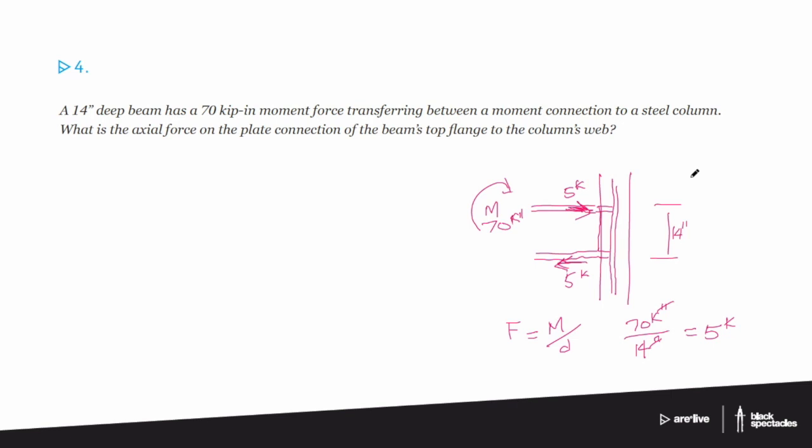They're a way to have a reasonable guess, to be able to answer reasonable questions about how deep a beam should be. It could be that in this scenario, it's not the worst case scenario, but it's pretty close to a worst case scenario. It's pretty safe if we assume this. What would happen if we assumed that fairly bad scenario? These are the numbers we would get, and therefore we have to make sure that the flange can handle that and the web can handle that. So we're making up these numbers as a way to see what a bad situation is, so that as long as we've kept within that, we're all okay.